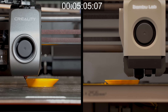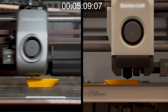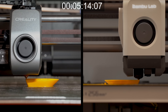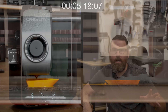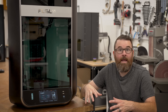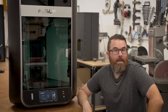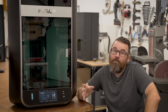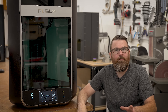You can upgrade the hot end, upgrade the nozzle, and get a little bit higher. I had a Creality K1 Max with an upgraded hot end and nozzle and I was getting almost to the 35 range. So 35 is about the peak that you're going to get from a standard printer. I know some of the Voron guys are going a lot higher, but that's generally the standard for a high-flow printer right now. So this thing at 110 — it's bullshit. It can't actually do 110. It does do about 40 to 50 very reliably, and you could probably print most things at about 50 and be okay.